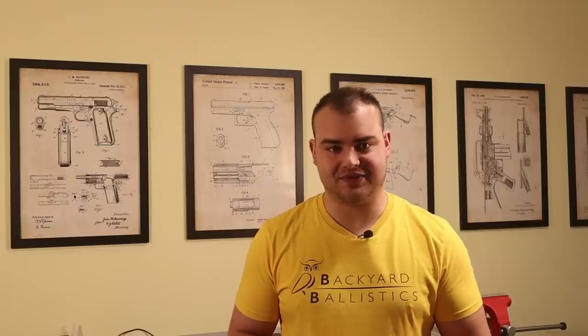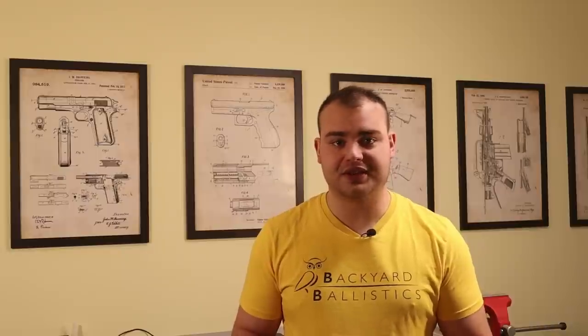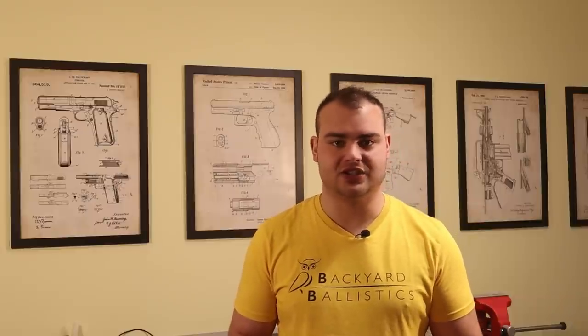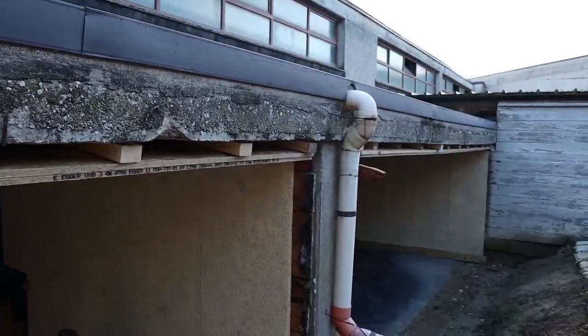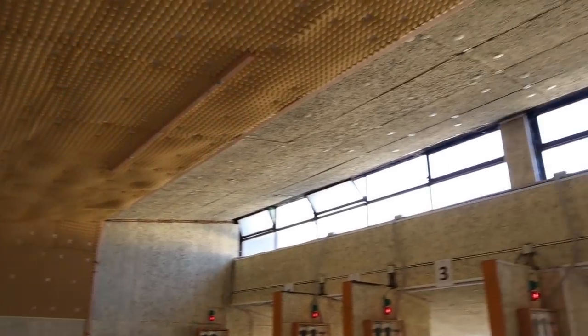Any hard surface situated in the shooting area must be covered with a softer material capable of catching bullet fragments, and this includes the roof, floor, and walls of the shooting range. Wood is the most cost-effective solution — placed in front of the hard surface so that a couple-inch gap is left between the steel and the wooden board. If a bullet were to hit the wall, it would pierce the wood, smash against the hard surface, and get broken into small pieces that remain trapped in the gap. Each and every wall from the shooting base onwards, including the roof, is clad in wood with a gap in between — you just don't see it here because of the acoustic panelling.